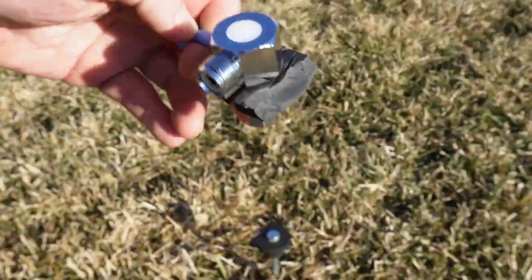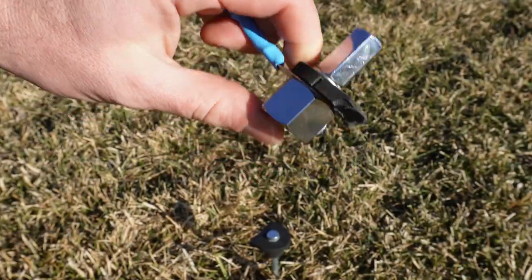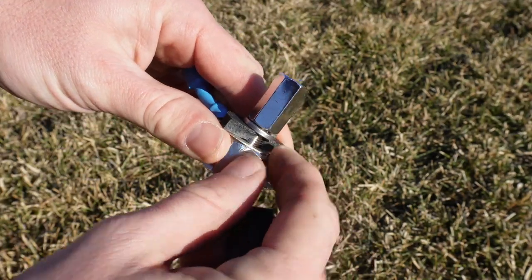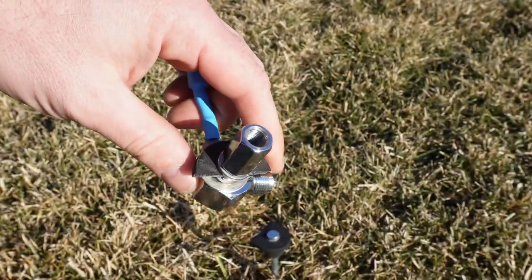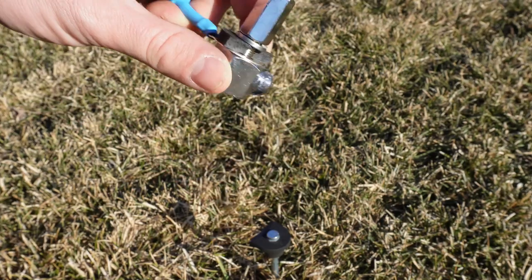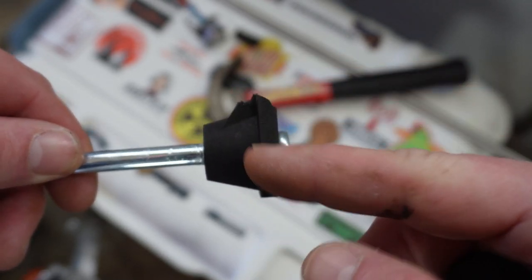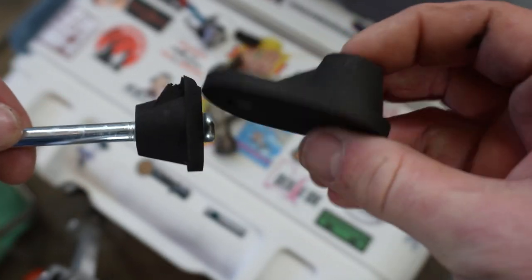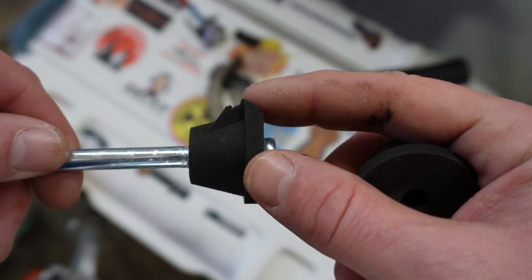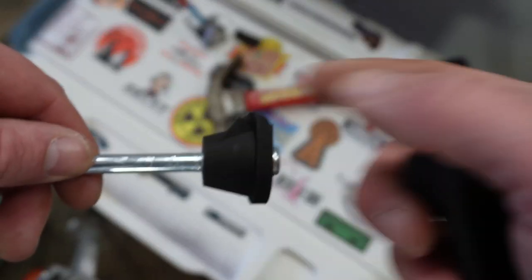You see that? So already that's a test — maybe we need to be a little bit more gentle when we're pounding this in, because that was a weak point. As you can see, it actually broke right where I had this all tightened. Back to the drawing board for Ham Radio Dude Spike 3.0. We could call it coincidence, but if we look at where it broke — it's right where I used a grinder to take away a little bit of that angle so I could fit the elbow connector. That might have loosened this up enough where, hitting with the hammer, there was nothing under there because I grinded it away.